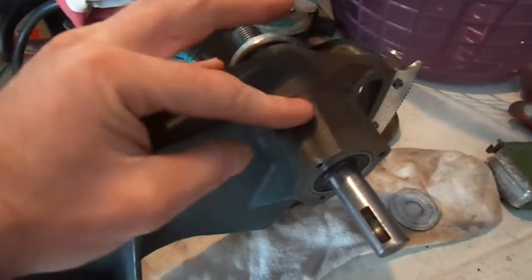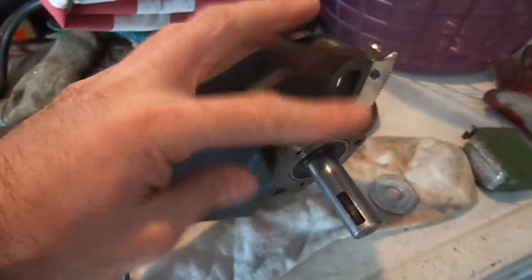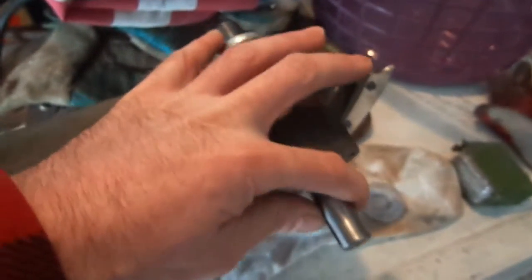And these you don't need to heat up, because they're already sized for that. I mean, you can if you want, and then your bearings really will just slide. They'll flop in there, but there's no need to heat the carriage up, the cups. All you really need to do is freeze your shaft to shrink that metal down, and then your bearings will slide right on. But that's it. It's pretty simple.